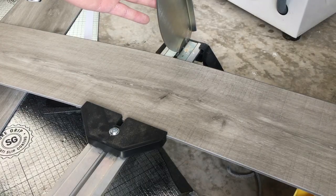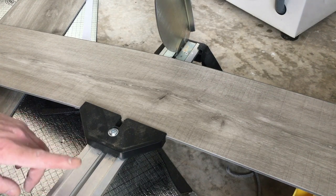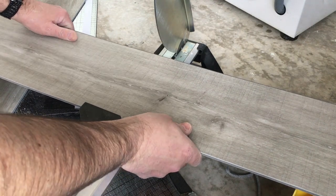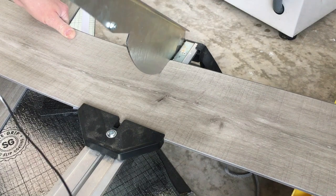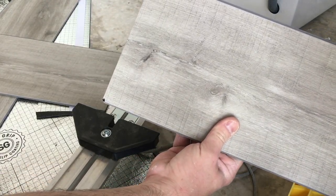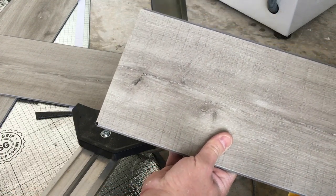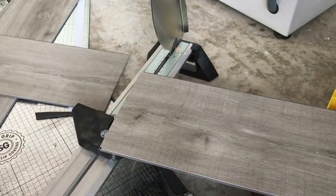For the straight cuts for this type of flooring I use a laminate floor cutter - I use it for vinyl plank as well. Basically just line it up, put the lever down and guillotine it. It gives you a nice straight cut. You can see how easy it is to cut this stuff - and there's no dust, no mess. You can see why it's a floor cutter I choose all the time: good quality, very easy to fit, and no mess.